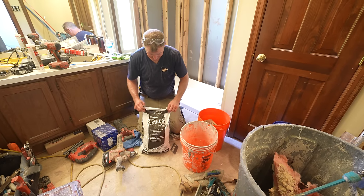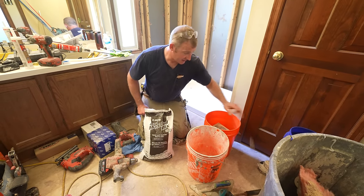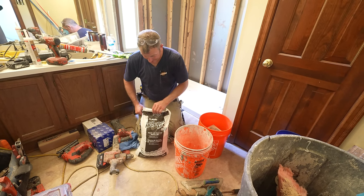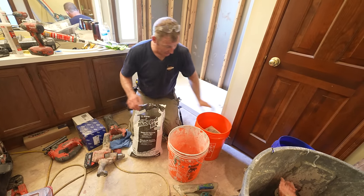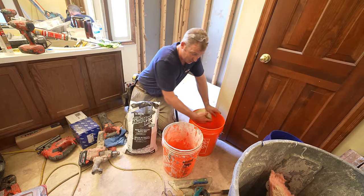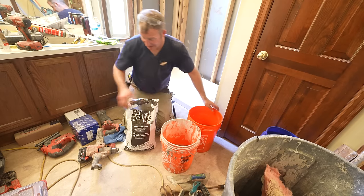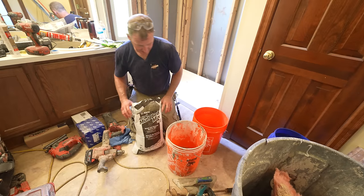To set this pan we're going to use a four-to-one mud mix. You could use any type of mortar, just make sure it's not aggregated — no rocks or anything in it. I like using the mud bed mix since I always have it on hand for regular shower pans. We're going to make this a fairly loose consistency — about three quarts of water per bag to start, then thin it out a little as we go.